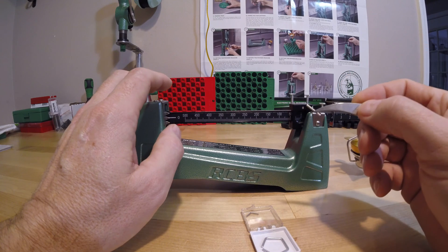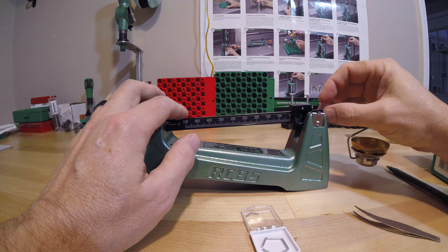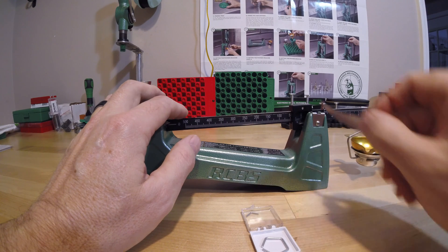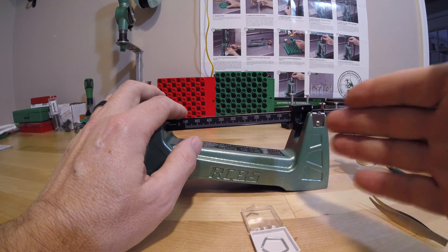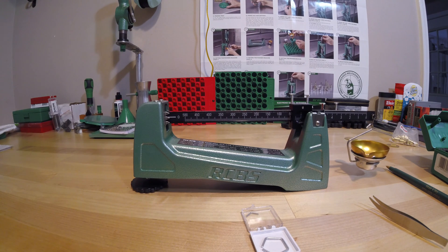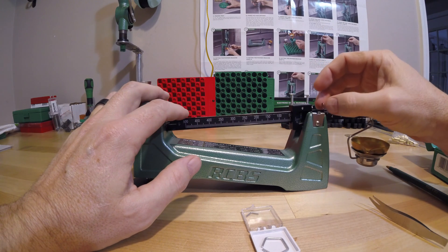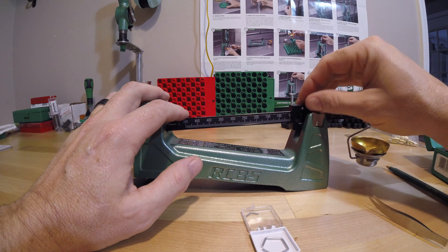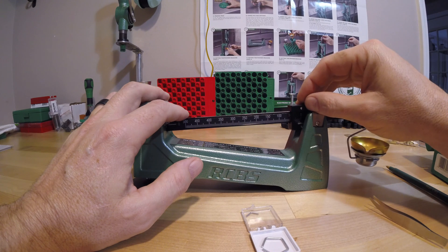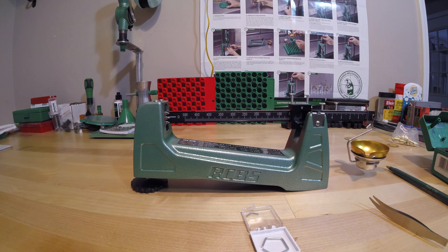Let's try five grains, and we're going to check it multiple ways. First, we'll check five grains using two two-grain weights and a one-grain weight on the tenth-of-a-grain scale. Then we'll also check it on the five-grain scale marker to see if we get accuracy between the two weight markers, then move on to the cylindrical weights. It is dead on. I'm looking at the scale from eye level — of course, there's always an opportunity for parallax — but five grains was exactly five grains measured on the tenth-of-grain scale. Now putting this back to zero and dropping the five grain weight over to the first indicator, which is five grains. Dead on the mark.